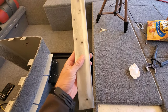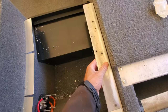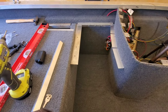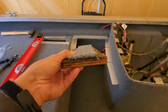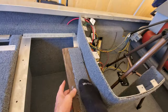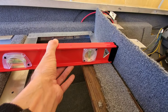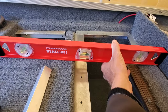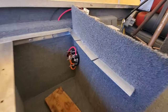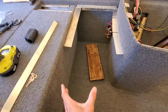Now I've got this piece that's a little bit bigger angled aluminum, a little bit thicker — it's 1/8 inch. This is just a piece out of a gutted boat. I'm going to recycle it and put it in here. Got this piece riveted in place; it's the basic framework with a few more parts to add. I'm taking a piece of old half-inch with the carpet and using a level as a plane to figure out where my framing needed to go. I don't necessarily care if it's level because the boat's not sitting level right now in the trailer — just using that as a plane to get me about where I need to be. Now I'm going to move on to adding some pieces on the inside for this storage compartment to attach to.